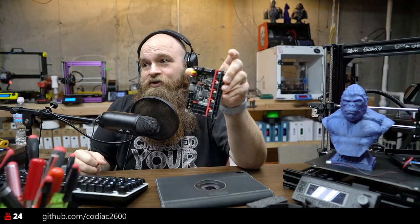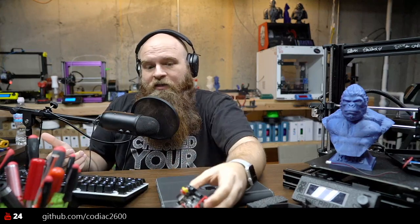So I hope this helps you in coding your SKR 1.4 or Turbo version. This is the Turbo again. Either one's fine. I think there's a lower price on the Turbo at the moment. You can get the Turbo with five TMC 2209s for like $65 on Amazon, which is a heck of a deal. So you get the best drivers on the market right now besides the 5160s, and one of the best boards on the market right now for stock Marlin.